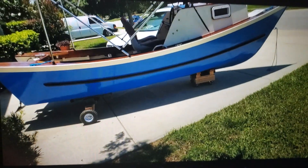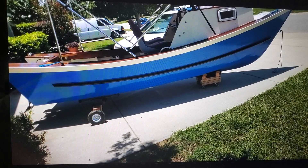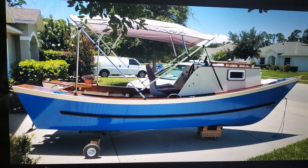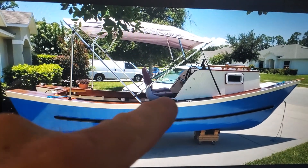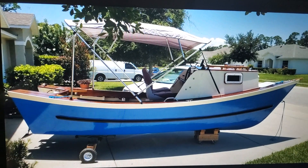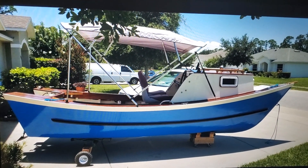She's a good running boat but had some issues. It would do porpoising over 25 miles an hour, and I fixed that with the hydrofoil. The fuel tanks are right underneath the seat and the battery is up forward. So I took as much weight off the stern and transom as possible.